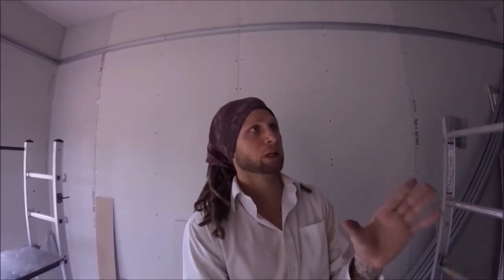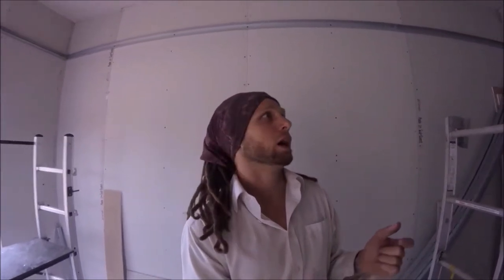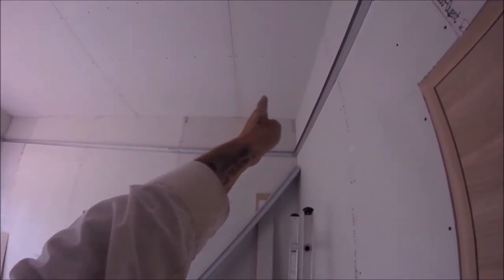I also decided on a 200mm deep shelf, 8 inches if you're American. So that'd be the depth of it. Translated, what that means is we need to build out a wall at 600 and also at 400 off of this perimeter stud that I've put up. I will get on with that and come back, because it's easier to see it rather than talk about it.